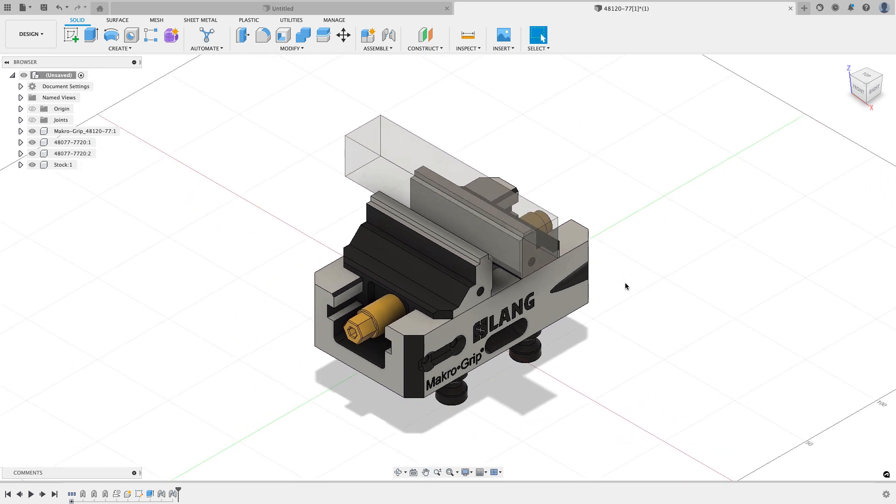You can see that you can download a vise from a manufacturer and pretty quickly get it set up to be parametric. Note that sometimes when you download vises from different manufacturers the 3D objects come in as bodies, in which case you'll have to convert those to components — you can only add joints to components, not bodies. I hope that helps you understand how to set up a self-centering parametric vise. If you have questions leave them in the comments, or email me at kevin@mechanicaladvantage.com with ideas for future YouTube videos. As always, thanks for watching.